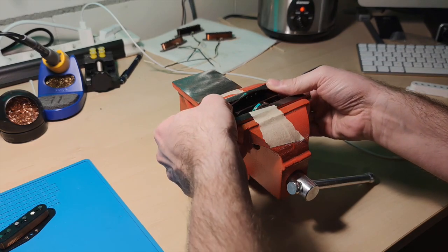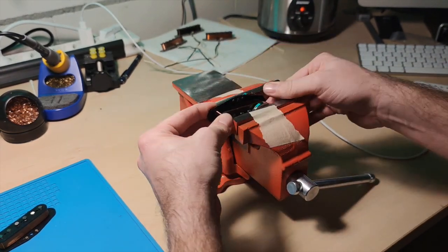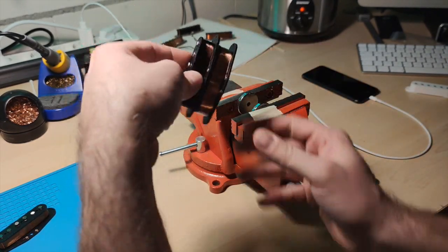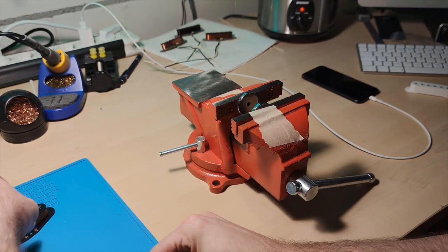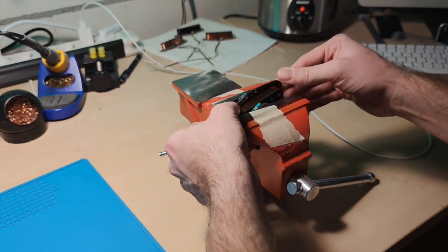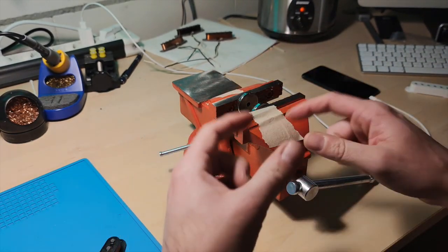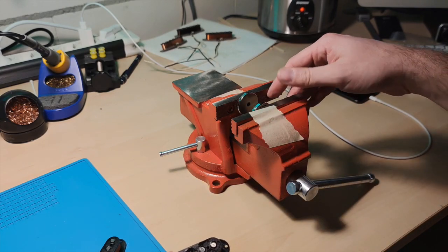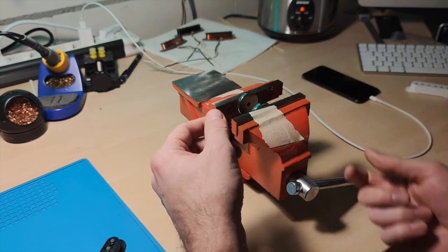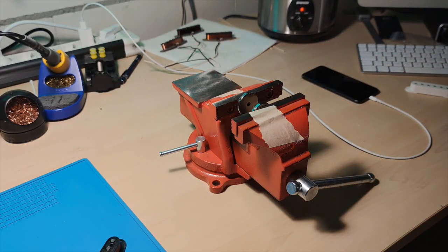I do this with the other two pickups, taking them in the same direction. Now you can see they're all magnetized to the full strength of the magnets. The clamp of the vice is set so that the gauss strength is to my specs — I have a gauss meter to measure it. If I want to demagnetize, I change the polarity by putting the blocks of the vice a little further away, or by passing the pickup in the other direction. This is really a thing of trial and error and you have to experiment with it.